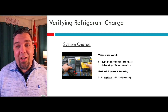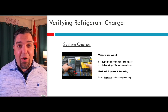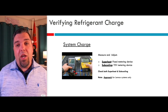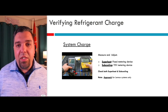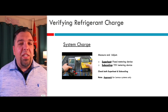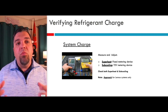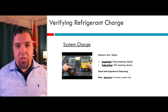Prior to these electronic gauges, it used to take a while, and by the time you figured out all the math, everything in the system had already changed. When you run the system before you adjust refrigerant charge, a couple of items: you need to have a load on the unit. Unfortunately, early in the spring — especially in the northeast — you're probably not going to be able to adjust superheat and sub-cooling. You need it to be probably at least 60 degrees outside, with some latent load. If it's really dry, probably not going to happen. You've got to be able to remove moisture from the coil, get that wet coil, in order to then be able to adjust the refrigerant charge.